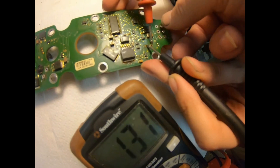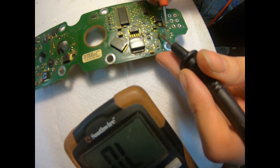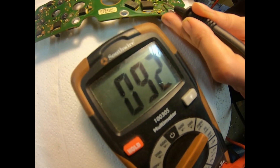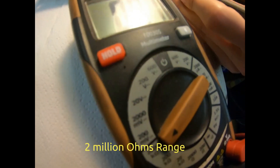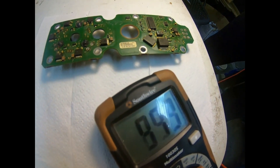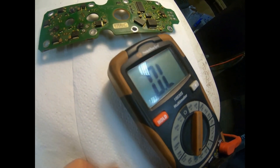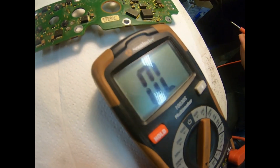You're going to check across that large capacitor. This is a very large capacitor here on the top side of the board — you're going to use the bottom side of the board to check it. You should get a pretty high resistance and you should see it charge. That's on the 20,000 ohm scale on the meter. The large capacitor is almost a mega ohm — 0.97. That other one is on the two mega ohm side.